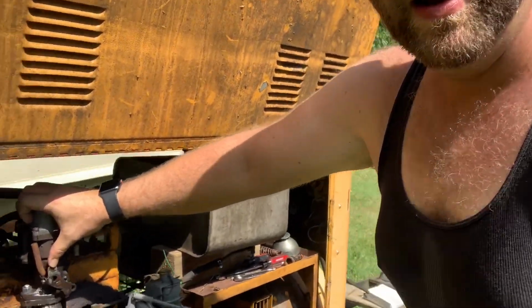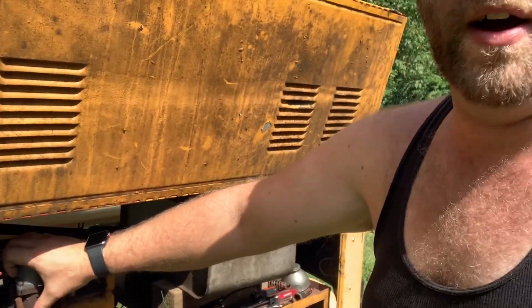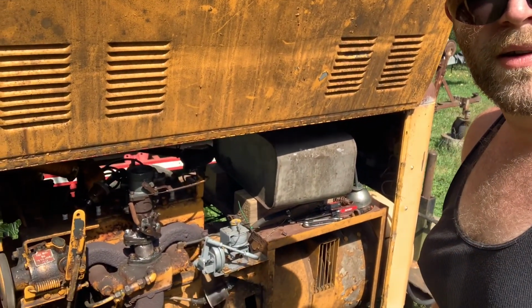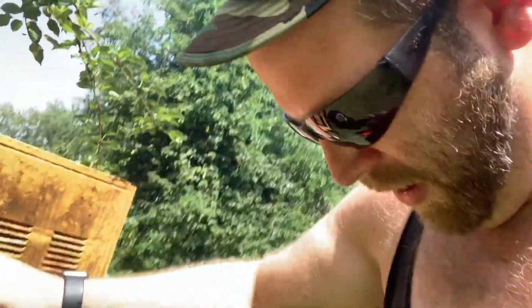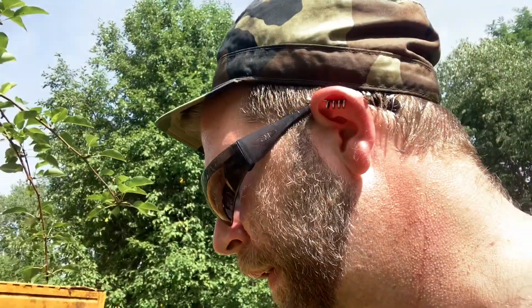Well, folks, that was one gigantic leap backwards. To keep it running, I'm having to keep my hand over the intake, with a half choke, to keep the thing running. Watch what happens when I take my hand off. Runs out of fuel. This jet set is too lean, way too lean. With the other jet set, at least it ran, and it would run on part throttle and on open throttle, but the transition was messed up. So now we got to try something else.